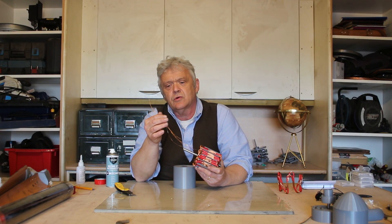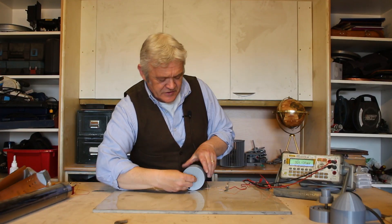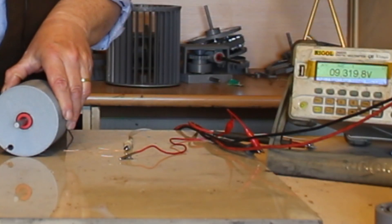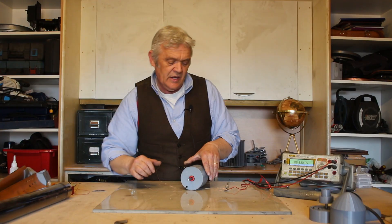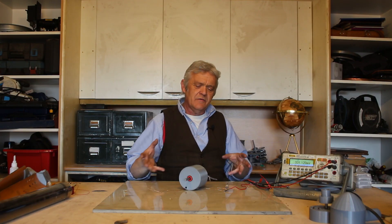We have three coils so we have six wires. Each will generate the same because they're identical coils, and we can connect them in series to increase voltage or in parallel to increase amps. I've got a single coil wired up to the voltmeter — spinning it by hand gives us nine volts, no problem at all. So connecting all three in series would give us 27 volts, which is pretty impressive. This generator is genuinely more efficient, more powerful, and a lot cheaper than the kind people have been buying or making.